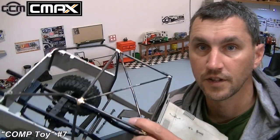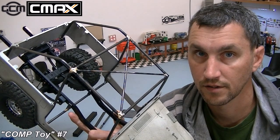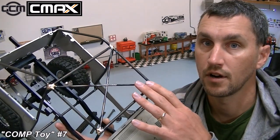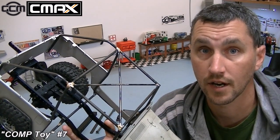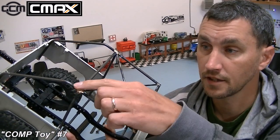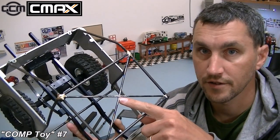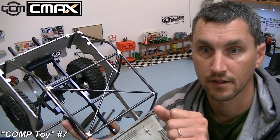I will say this — this X just filling in the tube work here on top has made the cage so ridiculously strong. It doesn't make any sense, it just doesn't make any sense. So strong that when I took the 1/8th straight rod that I'm using — it's a solid steel carbon rod, there's no coating or contamination on it at all, so it welds really nice — I cut the lengths and where they intersected I actually dremeled them.